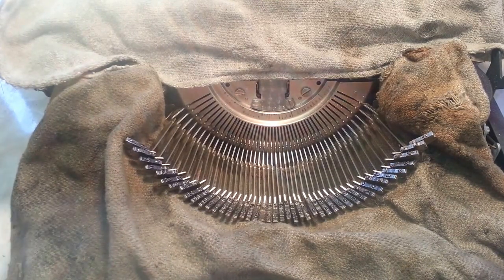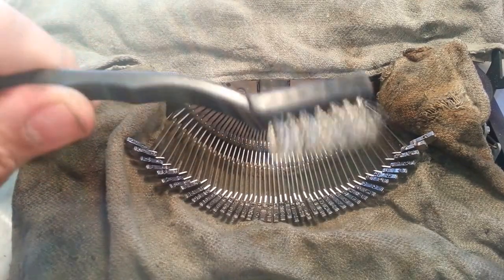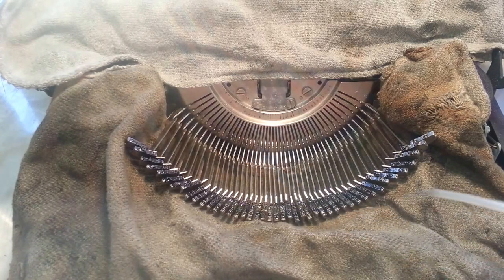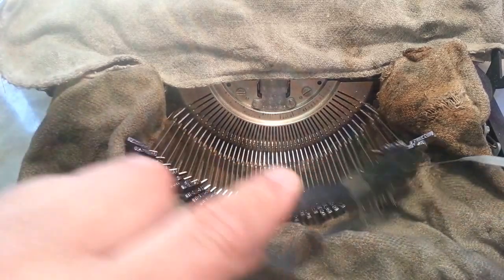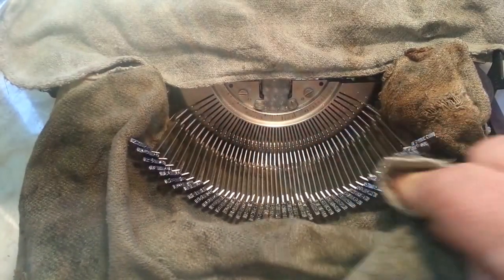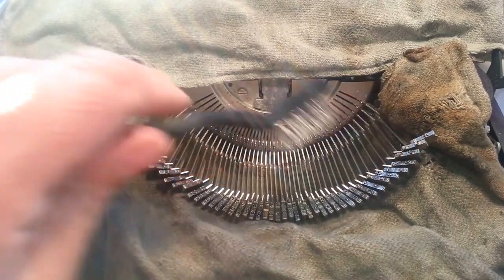And we're going to find there's a wire brush here somewhere. Wire brush — this one's pretty new. You go through these pretty fast, but simple as pie. Soak on some lacquer thinner liberally, maybe a little bit of rubbing initially. Then take a corner of this rag and wipe off the immediate excess, which would be heavy at first. Repeat.